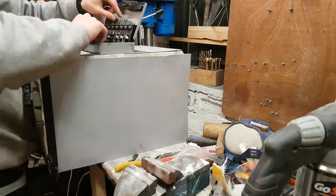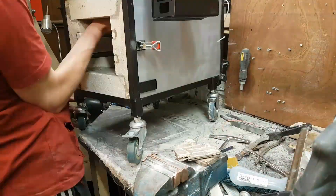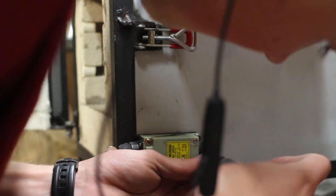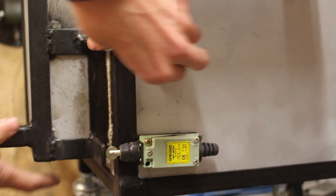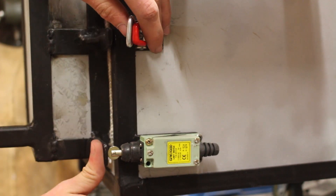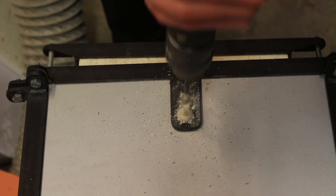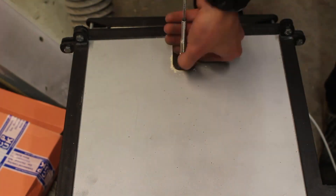The next step is to reassemble all of the frame which has already been painted now, and I think it looks pretty good once it's together. Here you can see the door mechanism and the latch working, and you can see the door presses on the interlock and turns it on. Right at the back of the oven on the top here is where I'm going to mount the thermocouple — this is the mount that I welded on before and I just need to drill a hole all the way through.